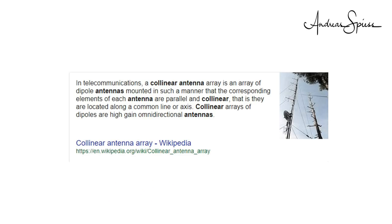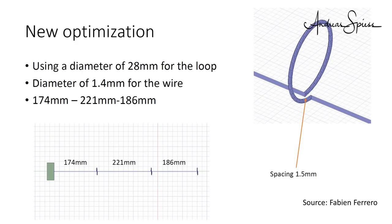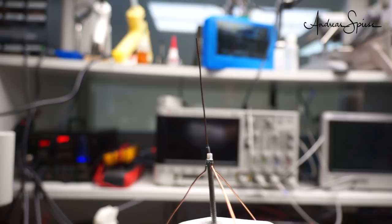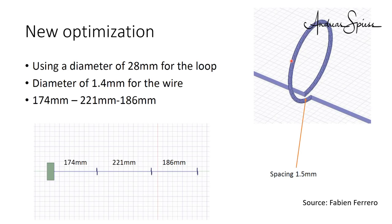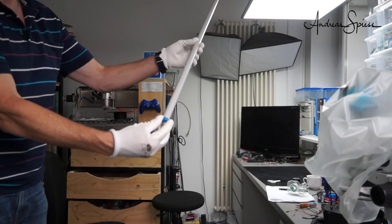I already mentioned the term collinear antenna. You get them in different shapes — some are made of short pieces of coax cables and others are made of wires of a particular length with 3 loops. They are not complicated to build and very cheap. Compared with a ground plane antenna, where we only have to hit one measurement, there we have more choices: the length of the 3 different parts as well as the diameter of the loops. The antenna from TTN uses only 15 mm loops and therefore fits a widely available 20 mm PVC pipe.